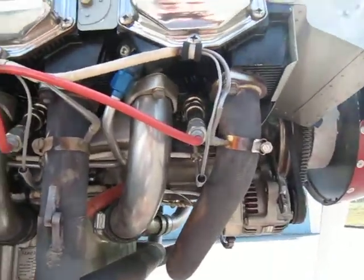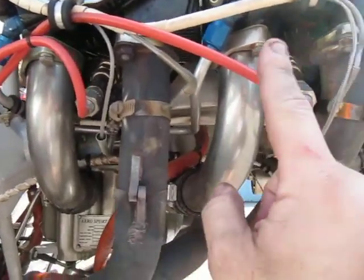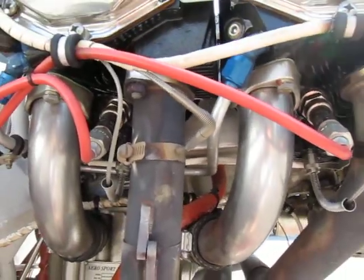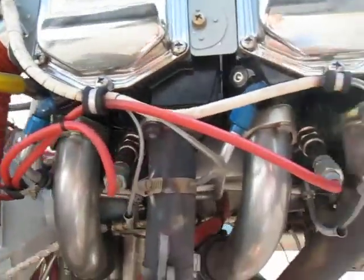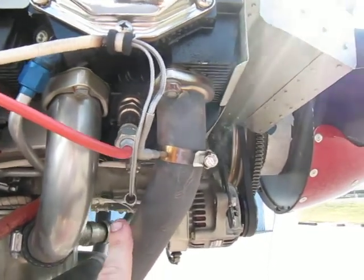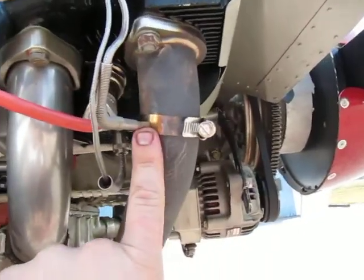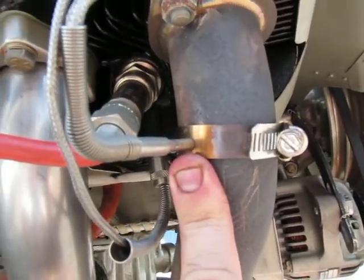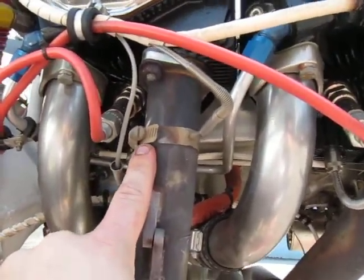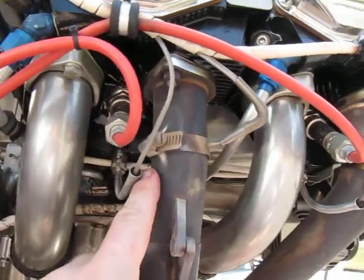On the lower half of the engine on this side, these red lines are for the spark plugs, driven by a traditional aircraft magneto. These silver wires right here — one is for the cylinder head temperature, and one is for the exhaust gas temperature. These are just simple probes, held in place by standard clamps that you could buy pretty much anywhere.